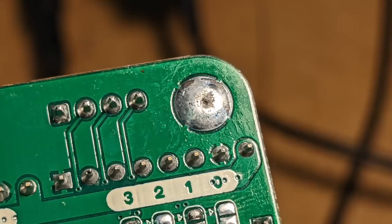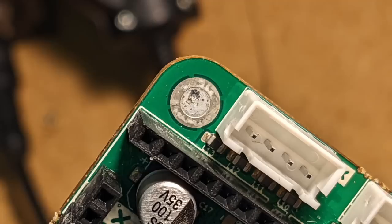But it has been a struggle trying to tune the process to get it to work right. We've been having a really hard time protecting certain parts of the bottom of the board that we don't want to fill with solder — like the mounting holes, for example. When we dip the board in, it just wicks solder up into the mounting holes and then you can't mount the board anymore. So we've been putting Kapton tape all over it, which takes forever. It works really well but it's a really annoying step and we don't want to just fly through Kapton tape.